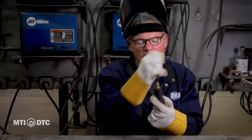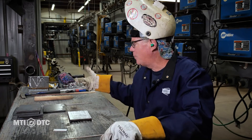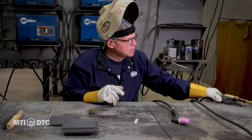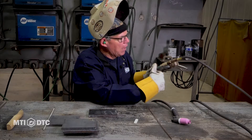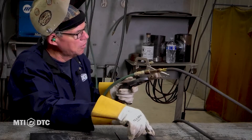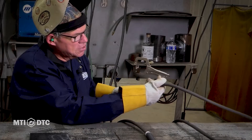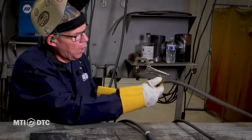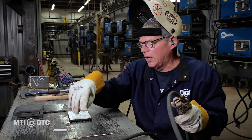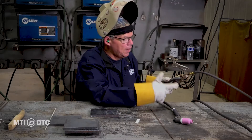The machine setup is the exact opposite of our stick. So here's what we've got set up: this is a power lead — here's our stinger. This goes to our argon bottle. This is our power lead that goes to our TIG torch, stingered up just like that. It's on the negative side of our welder, and the positive side is the ground over here that grounds the table I'm sitting at. Very simple to set up — if you've got a DC welder, you've got TIG capabilities.